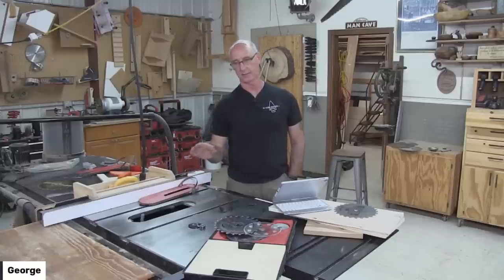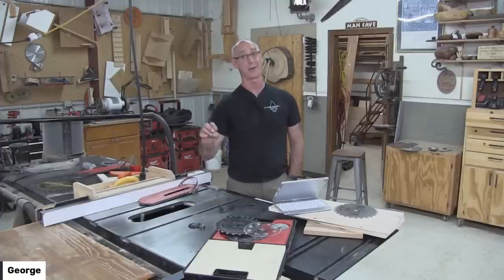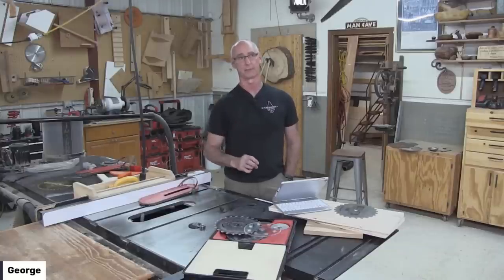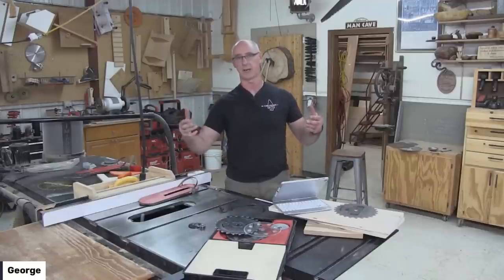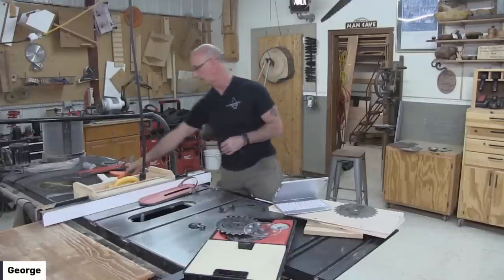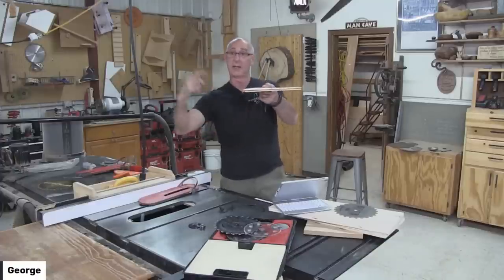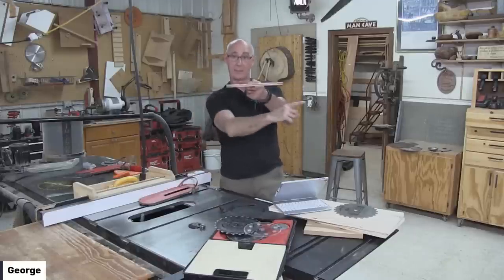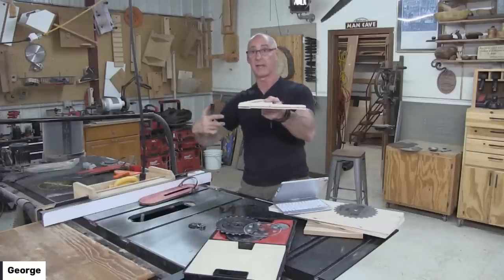6 and 8. So the deal with diameter of dado head in the 10-inch category, I've used one once, never on a table saw. It was a twin tenoner in a commercial cabinet shop. And I've maybe never seen a more intimidating machine. A tenoner, just what it sounds like, you could feed a piece of material horizontally through this machine and it would tenon this end and tenon this end. It did that by a 10-inch dado head above, a 10-inch dado head below on both ends. You change the spacing between them. So as this went, it left behind that tenon.